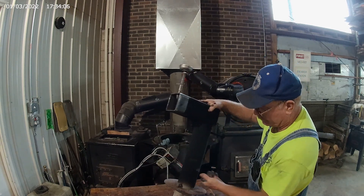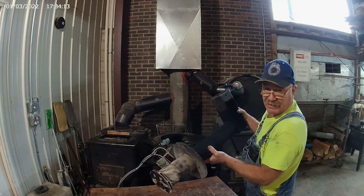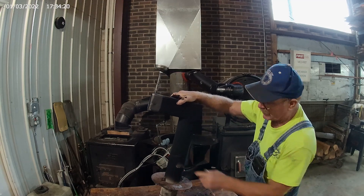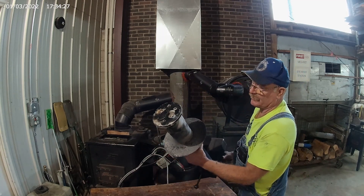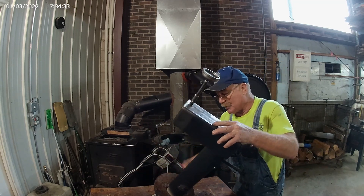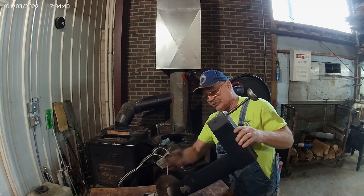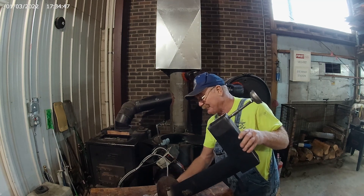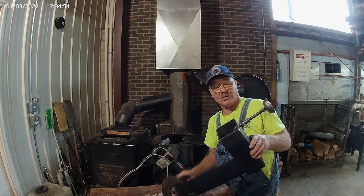We're thinking about this heat shield — you can see it's usually glowing in there, and it's not going to last very long because it's made out of steel. We were talking about making them out of stainless so that it doesn't deteriorate. You can see we put a clamp on either side; it's made in two pieces and bolts together so you can slide it up and down your stalk until you get it in the right place. If we get another one up in there and keep it burning that hot, that's a pretty efficient oil burner.